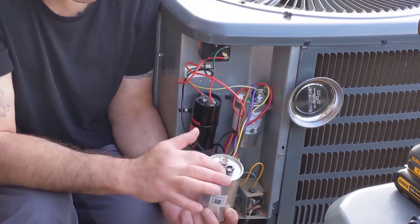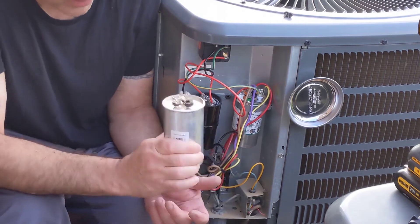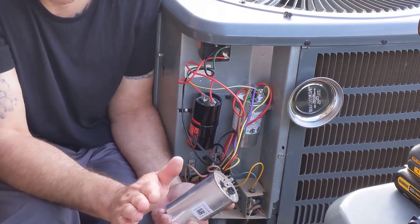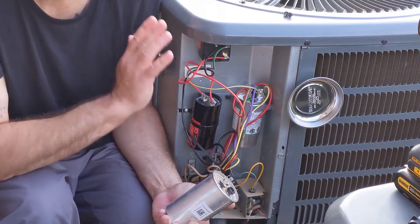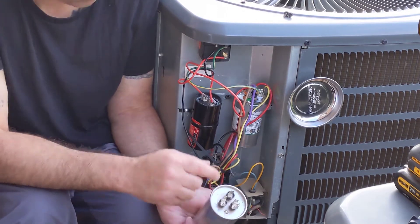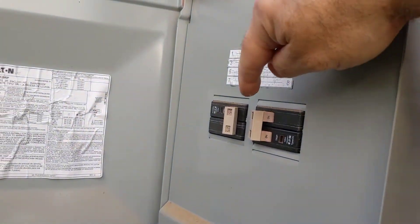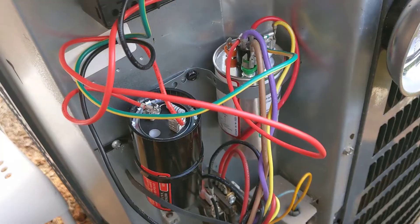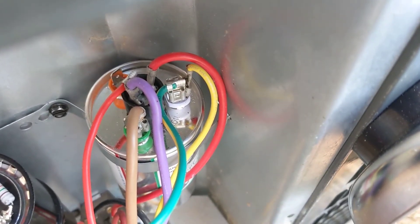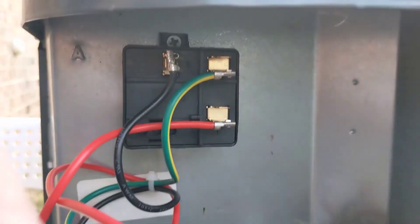It's always good to come in and take a look at your cap — if it's swollen on top or looks like it's about to go, you'll know. Always keep these on hand. Hard start kits will make your compressor last a lot longer. Like I said, I'm not an HVAC person — this is the first time I'm doing this. I watched a ton of videos; it's just common sense, putting wire to wire. It tells you right on the terminal — and I actually just got shocked touching the herm terminal. I'm a beginner! I'm going to shut the unit again just to show you the cap and new hard start kit I installed.